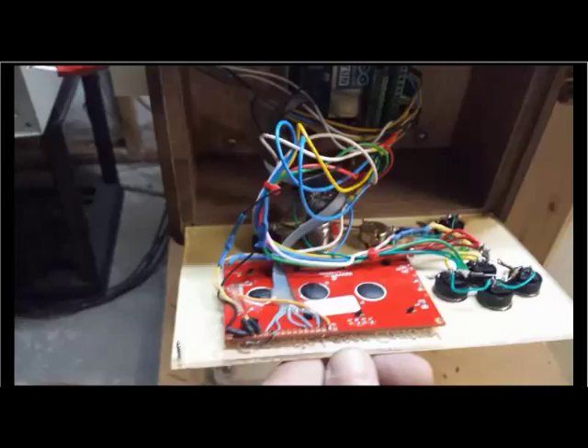Here are our four selector buttons beside the LCD. This is an Arduino LCD - it's very inexpensive, worth about six bucks. They come in two flavors. You can get a two-wire LCD, but I don't recommend it because it uses interrupts. We want to use interrupts to talk to our CNC system and be as fast as we can. So the easiest way was to use an LCD with a six-wire interface, and that is this ribbon cable that I've epoxied to the board after soldering six wires to it. These go off to the Arduino board.